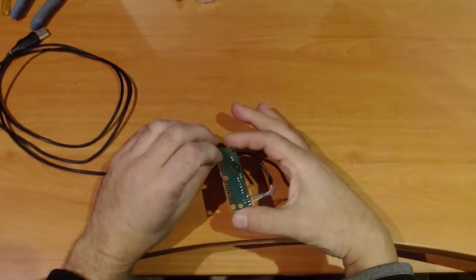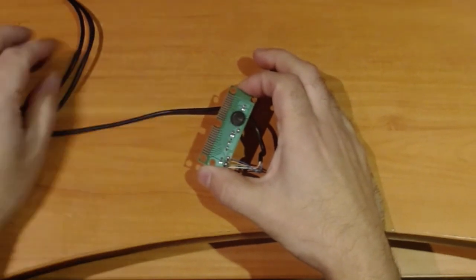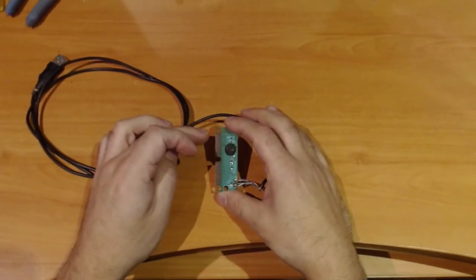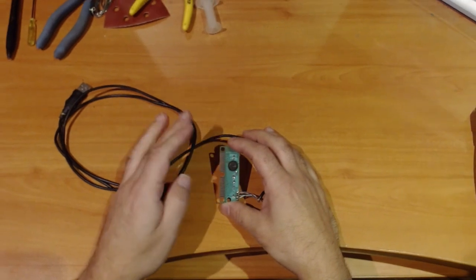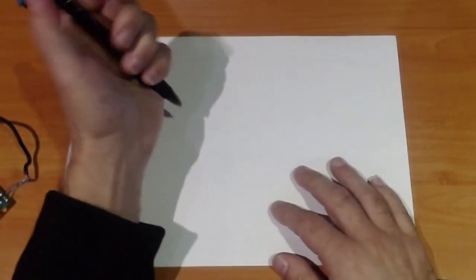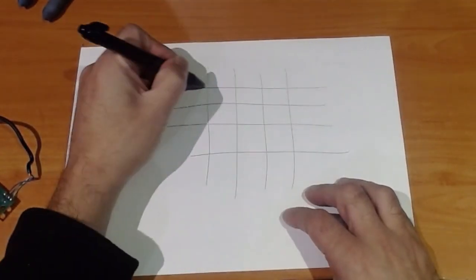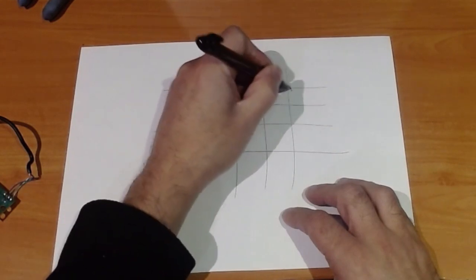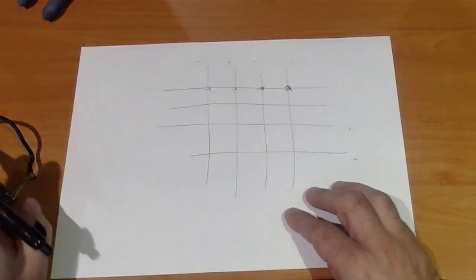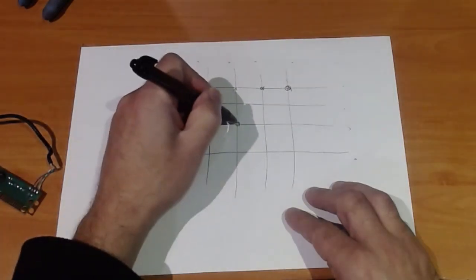It sits nice and tight on flat cable connectors with little plastic switches on it. This is basically a matrix, which means the keyboard has lines going this way and that way. If I draw it for you — you have several lines in each direction, and each intersecting point is where pressing a key connects two wires. There's a scan running between these wires constantly in the little USB keyboard chip, and each time you press a key it connects those two wires.